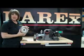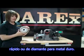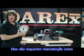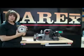The wheels we use are electroplated wheels. This is a CBN wheel for high-speed steel and cobalt. We also have them in diamond for your carbide application. This wheel doesn't require any dressing whatsoever, so it will do about 6,000 to 8,000 sharpenings.